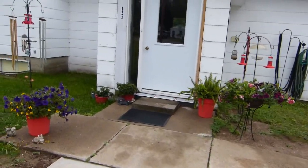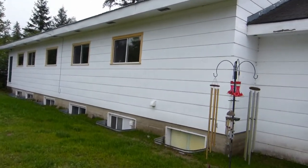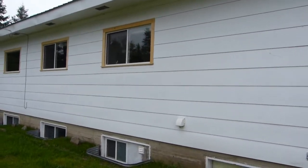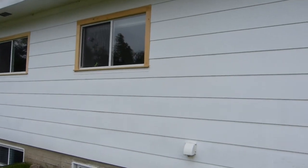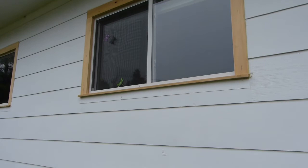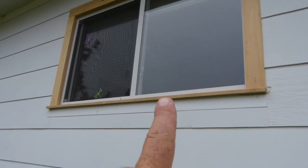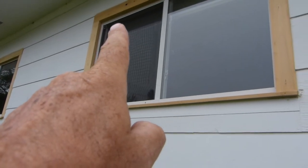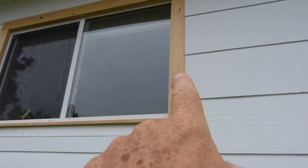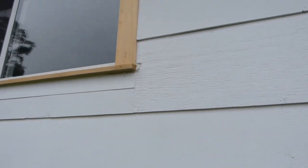The flowers are coming along nicely. One of the things I've been busy at is removing all of these windows and putting them back in properly, because the guy who put them in had no sense of consistency whatsoever, and trimming them out. There are seven pieces in each of these windows. There's the sill, and then these three pieces are all actually double pieces — there's a piece behind it so I have something to nail to with the trim. They're all trimmed out, all in cedar.